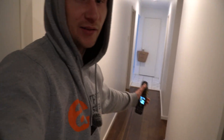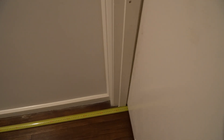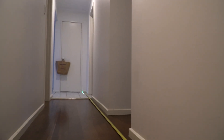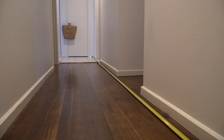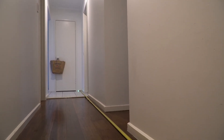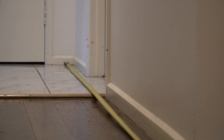Let's try the entire length of this hallway. I'm going to start with the tape and leave it stretched out so we can see it — it's belted into the skirting board at the far end, running the entire distance under the door. Looking at the tape, that's about 6554 to 6555. Now I've got the laser out and I'm butting it right in there above the tape measure. One of the potential problems is trying to hold it still on a target, especially one-handed. I got three separate measurements — I think that last one should be accurate. Let's have a look at what we have.